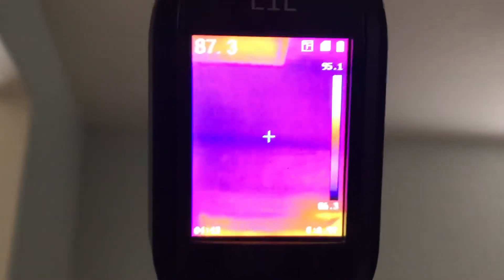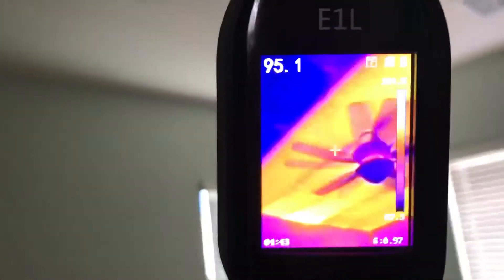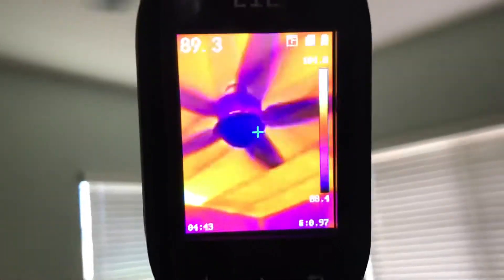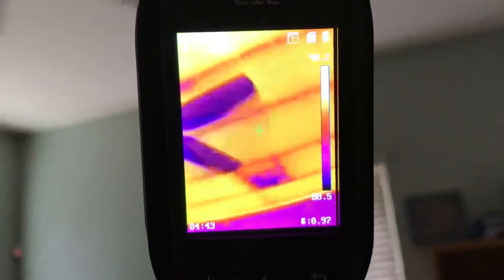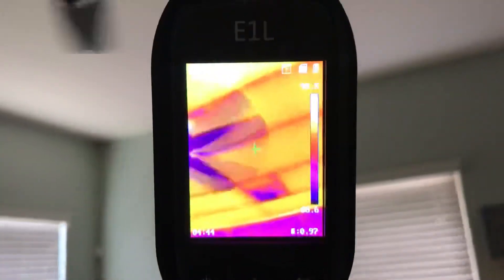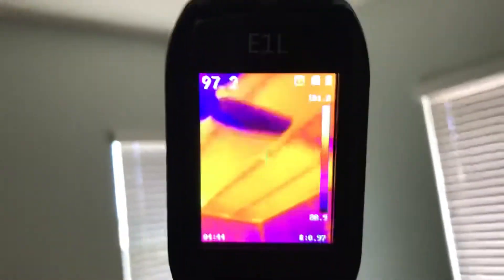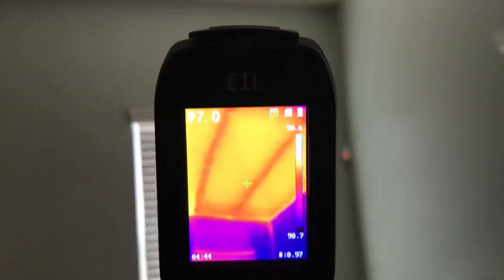See how it's blue? Look at the other part of the ceiling — this whole half right here is uninsulated. When they built the house, that part was left uninsulated, and that explains why this room is hotter than the others. Now let's go right here to the ceiling — I want you to really see it.